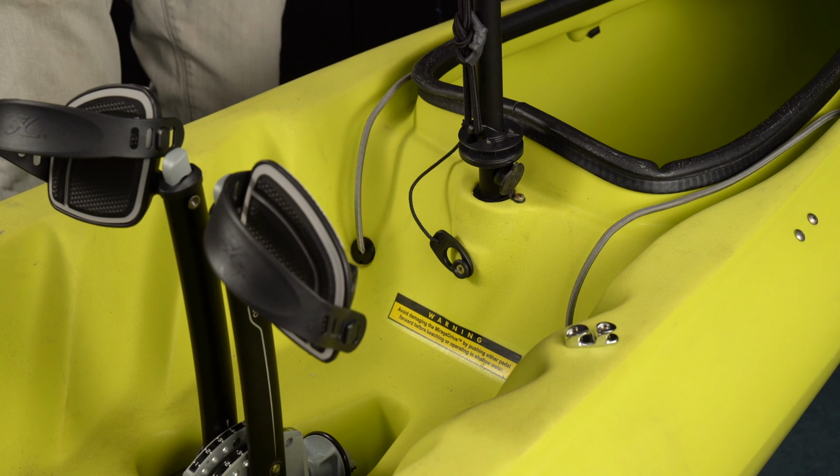So with this pad eye, I could install it right here. I would have to drill more holes and get inside the kayak to do the through bolt somehow, some way. There's a rod holder right here. So what I'm gonna actually go ahead and do is utilize this molded in threaded insert, and I'm gonna go ahead and replace it. In the Hobie catalog, you'll find both of these options. This is a pretty standard option, or this one's actually even bigger. If I install this here, I can run the bungee through. So I'll use the cargo space just like before. And then also there'll be room for me to attach that hook as well.